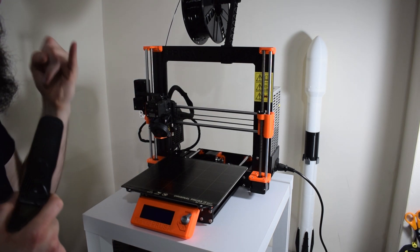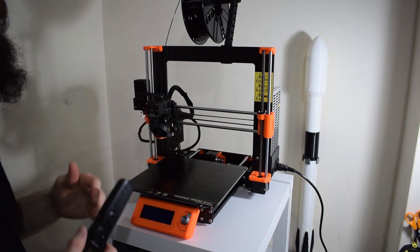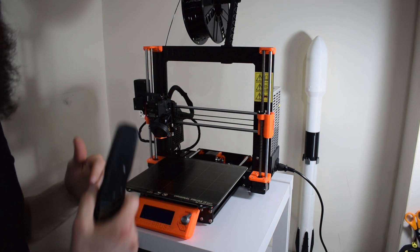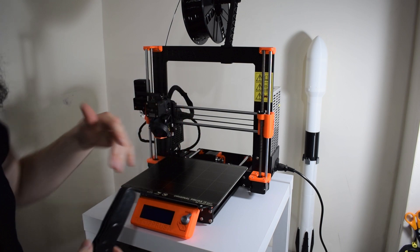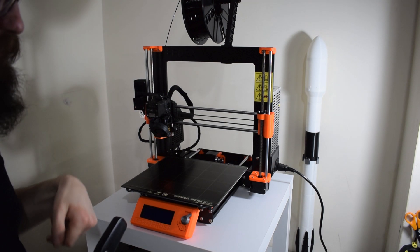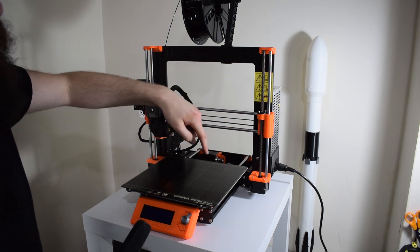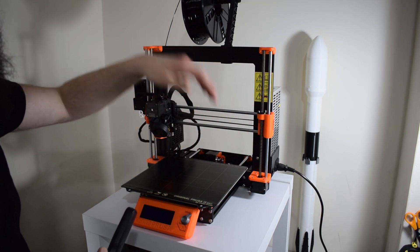The Z-axis is very slow, so it takes a while to rise up and come back down. During that rising time, while the X-axis has to come across, the extruder is still actually extruding filament. Even when you stop extrusion in the G-code, it still leaks out — you've seen it when you preheat your nozzle, you still get those little drips. That causes issues when you come back down to print — you get excess filament that drags along your print and looks really bad.